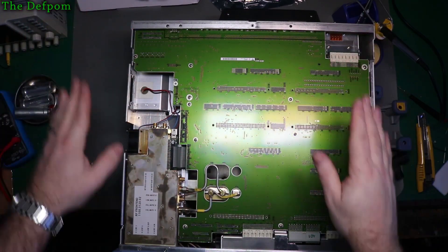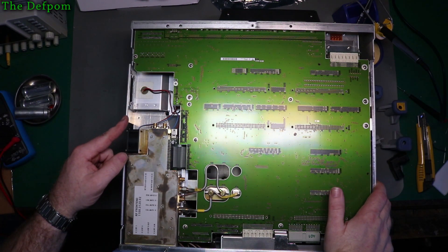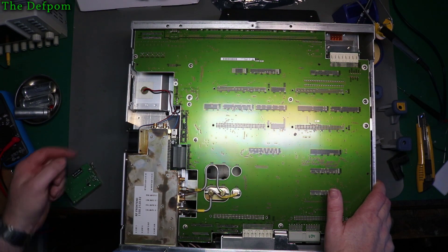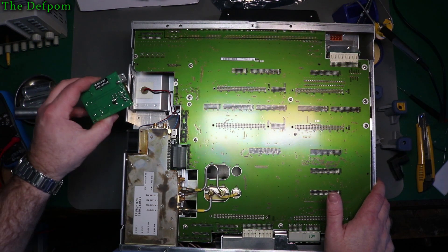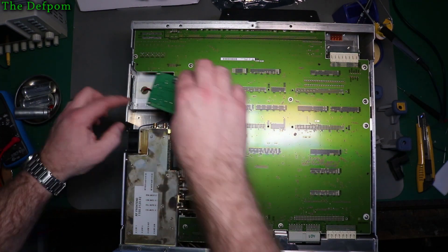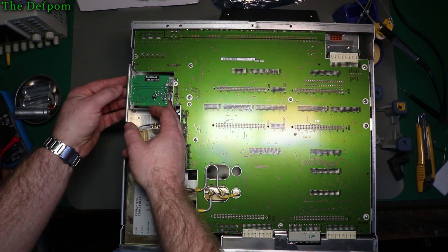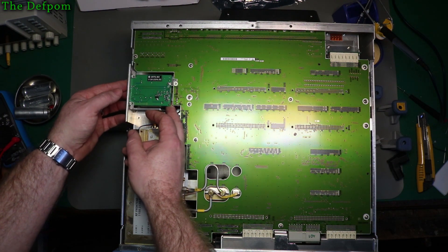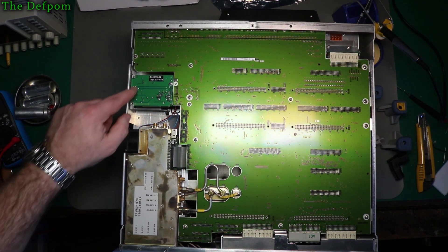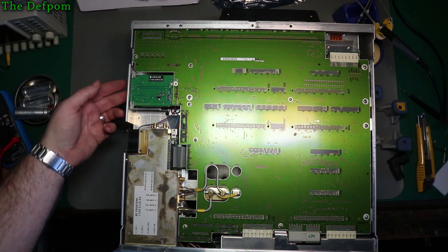So we've got the CMU200 upside down with the casing off. The module is supposed to go in here somewhere. Looking inside, I can see there's a female header pin mounted side-on, and a slot on the side. Let's try this way — there are mounting screws here so I'm sure it's the right place. There's a locating slot for that pin as well, which is nice. It fits onto those header pins — all I need is some suitable screws to mount it.